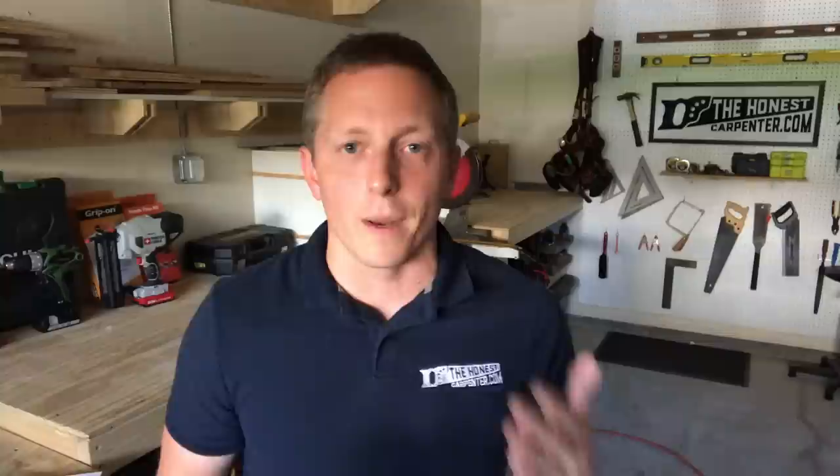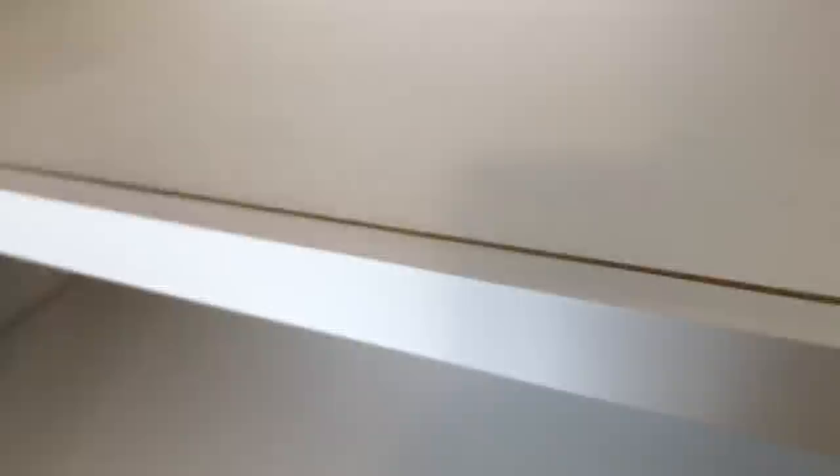As for using wood glue on it, companies like Titebond state that their product does not bond well to painted or primed surfaces — you're supposed to sand down to bare wood. But I'll confess that I've used wood glue on pre-primed pine plenty of times and still gotten a fairly strong yield. As long as you're not relying on it to hold extreme weight, which most shelving doesn't, I think you'll be alright. If you're nervous about it, just sand off the primer where the joints meet.